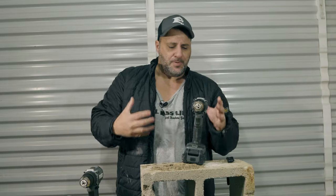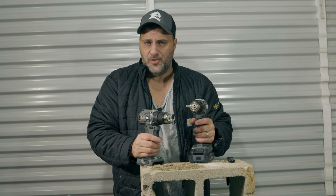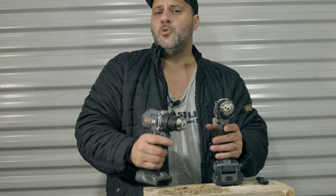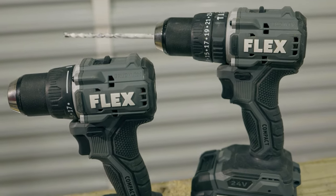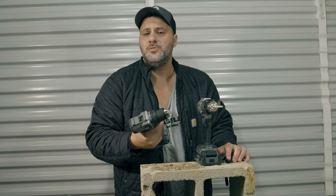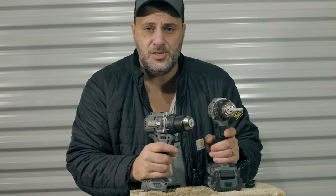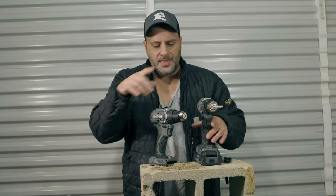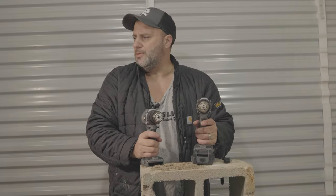What's best for me may not be the best for you. For me personally, I would never buy a regular drill over a hammer drill simply because of what I do — I need that hammer drill functionality, and I'm willing to deal with something that's a little bit bigger and more expensive. On the other hand, if you just need to drill through wood, plastic, or hang pictures and aren't planning on going through cinder block or concrete, then the hammer drill doesn't make sense and you can save some money with the regular drill. Remember, there are different grades, strengths, and RPMs on these drills — check out that video if you want to see DIY versus professional grade options. Share this video if you know someone wondering about the difference!